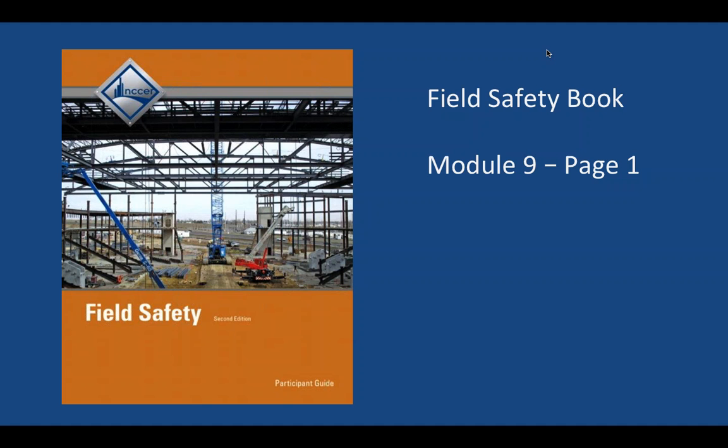Also, making sure that the material is something we're able to lift by ourselves. If not, what are we looking for? We're looking for assistance, or we're looking to get something automated like a fork truck, a dolly, something that's either manually powered or self-propelled. And then, of course, inspecting our path of travel, especially early in the morning and late in the evenings when visibility may not be ideal, we want to give it a little bit more attention.